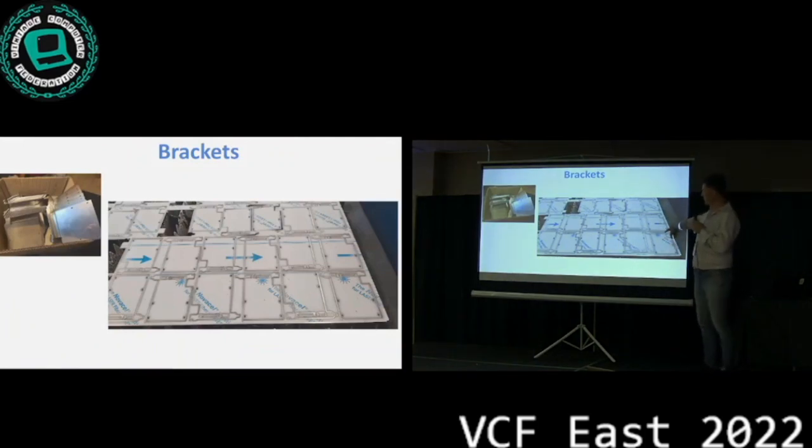And this is a photo that Simon sent to me from the production line. So they were all laser cut and then bent. And I had long discussions with him, because he was like, this double bend that you see there to keep the pins safe, can we optimize that away and just put a hole in? And I was like, well, yeah, that would work. But can we try to do it anyways? Because it would look much closer to the original if we had that double bend. And so these double bends need a lot more sophisticated machinery, basically, is the problem.